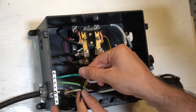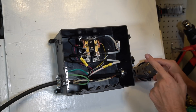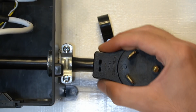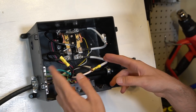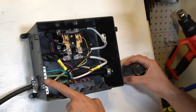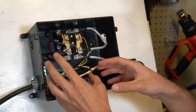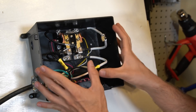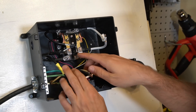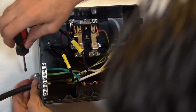Then do the hot wire — the black one — on the bottom terminal, connecting the two wires together. Now the RV power plug is completely connected. Tighten down the cable connector screws until the cable is secure and cannot move around. Take notice of how much wire slack you have; all wires coming in must reach the grounding block. You also want some slack so you have room to work — it is very hard to organize things inside this little box, and you don't want wires going into the movable parts area.